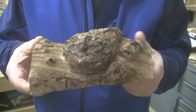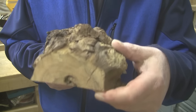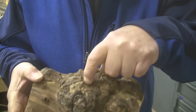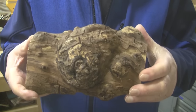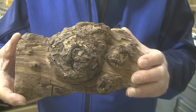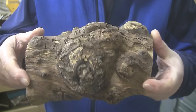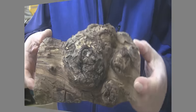The piece is about eight and a half by five by about three and a half inches tall. I'm going to find the center, take it to the drill press, drill a flat spot for my chuck jaws to set against. In the middle of that I'm going to drill a hole for my woodworm screw. We're going to get this mounted up on the lathe and get to turning this beautiful piece of mesquite. I can't wait — it's just gorgeous wood. See you over here at the lathe.